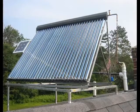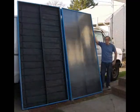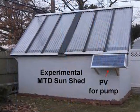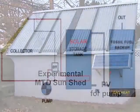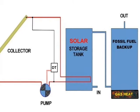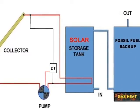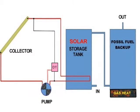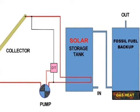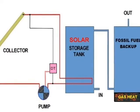Collecting the sun's heat is just the tip of the iceberg when it comes to solar hot water heating systems. Storing the sun's heat is also important. The job of transferring heat from collector to storage tank is done with a circulator pump. But how does the circulator pump know when to turn on and when to turn off? This is the job of the differential controller. The differential controller compares the temperature of the collector with the storage tank temperature, and when the solar heat is available, the pump is switched on.